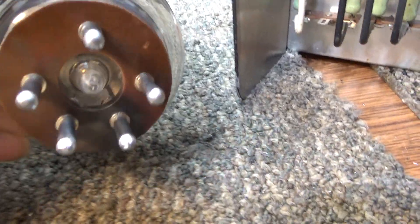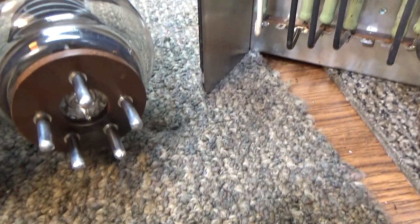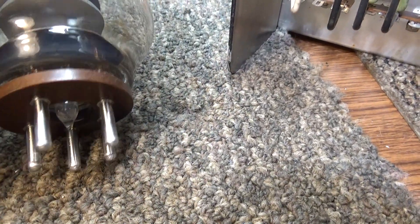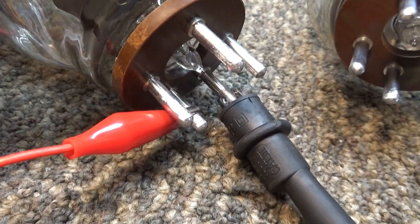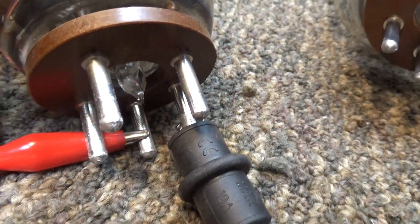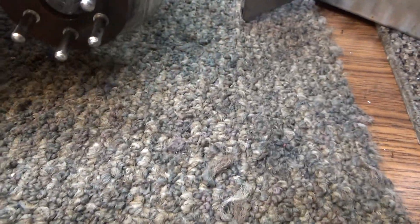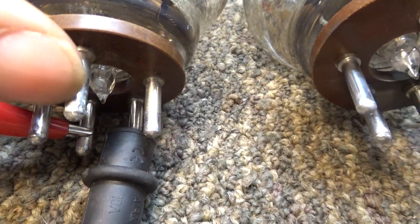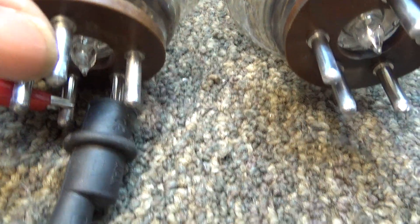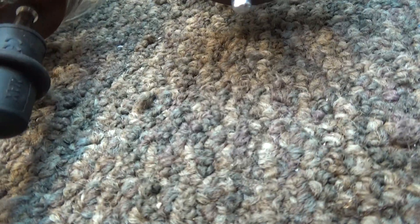On this one I cleaned the pins with the Dremel - and on this one I did not Dremel it yet. Hopefully you can see the difference: the Dremel-cleaned one looks much cleaner, it's smooth, where this one is not smooth and it's not going to get a good connection. You want smooth on there, so we're going to Dremel this one and clean the pins.